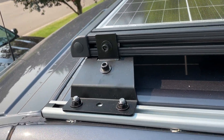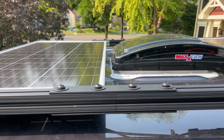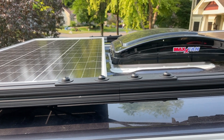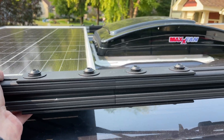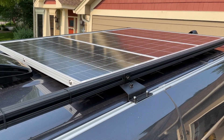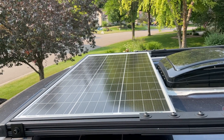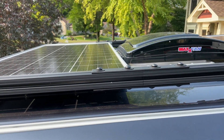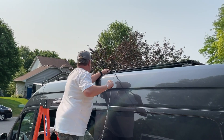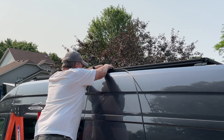You can see how these brackets worked out — it's perfect. I'll put a link below for those. Here's my little splice: I just put a plate on the top and a plate on the bottom with regular screws that come with the 80-20, and that sucker's tight — it's not going anywhere. You can see there's our Max Air fan and the rest of the panels. They are in. There's a total of three brackets on here. I'm pretty happy with how this turned out — it's pretty low profile, looks pretty good from the ground. I'm putting this cap on the sides to keep the rainwater and ice out of the track.